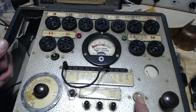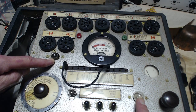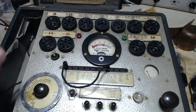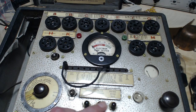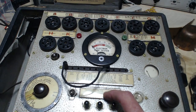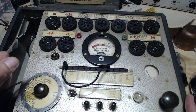This indicates a short — actually this is more like a fuse, I think, if the filament or something like that. This will come on bright. This guy is a short indicator. The short test is done by putting the tube into one of these two sockets. The test buttons are green, black, red. You're pushing the green button most of the time; occasionally you have to also push the second button to test the second plate. And this one is a diode test if we're testing a diode. Electrically a diode and rectifier are the same thing, but I think the way they're treated in here is not the same.